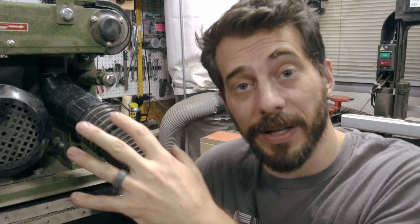The main changes I'm going to make here are about moving this hose away from the machine. I'm going to take its opening and pull it further out of the machine, which makes the adapter a little bit bigger and more rigid, and will allow me to keep the adapter on the sander even when the hose is not in there. As it stands right now, I have to put the hose on the adapter and then kind of feed it in to latch onto the machine. But since Fusion is parametric, I can make all of those changes and iterations and just reprint another version to try it out.